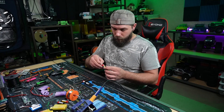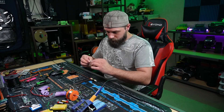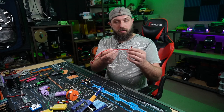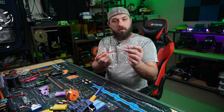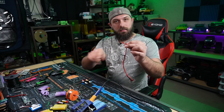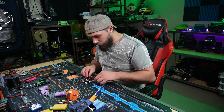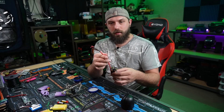With our batteries all strengthened up and not floppy, I can now start making my parallel connection. I'm going to pull out my tabs on both of the positive ones so I can see them easily, and then prep the negative side as well. I've already made a little wire extension with my battery connection on it and a short pigtail length. I've stripped the wire back in the center and added solder to it for an easier connection. So I'm going to hook one battery here, the other one here for the positive side, and hook both negatives together — that's hooking it into parallel. I've got all connections made: negative to negative, positive to positive, and my pigtail.